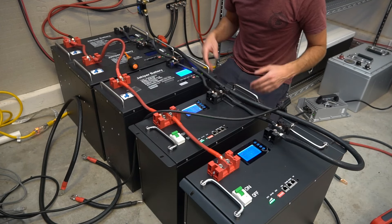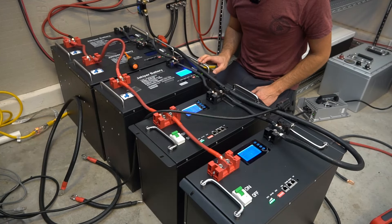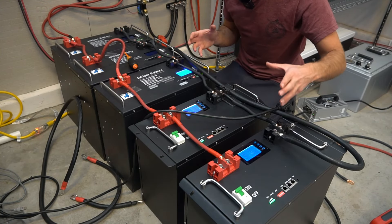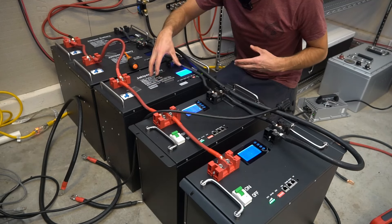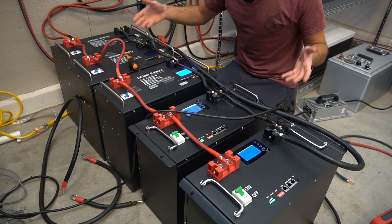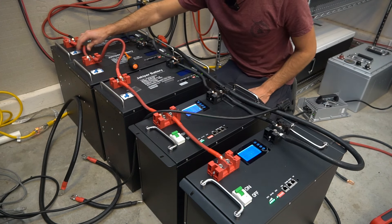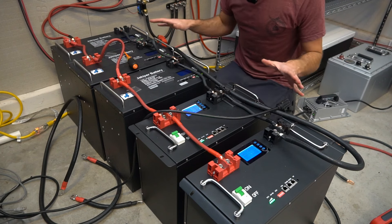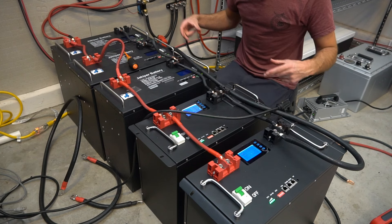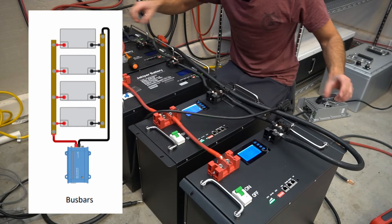If you can't afford bus bars, that larger conductor solution might work. There are other wiring configurations available in Victron's Wiring Unlimited PDF, which I'll link below. Now, 30 amps versus 47 amps is a massive difference — if you're pulling this rate every single day you're going to overwork those batteries and some will lag behind. These conductors are getting hot, which is not good. To avoid all these issues with current sharing, use bus bars with equal length conductors and connect your loads and chargers on opposite ends in a diagonal configuration.